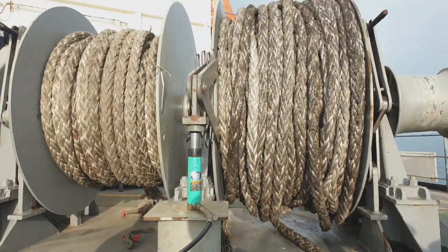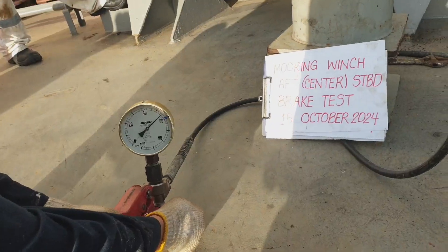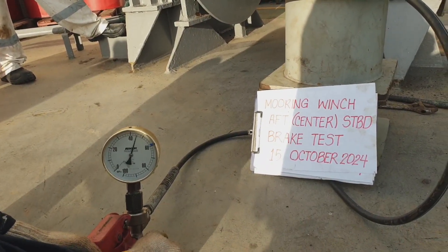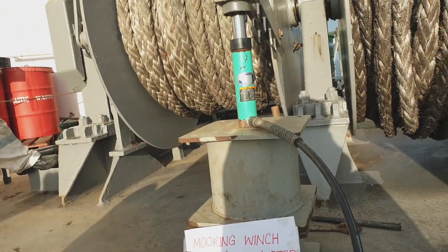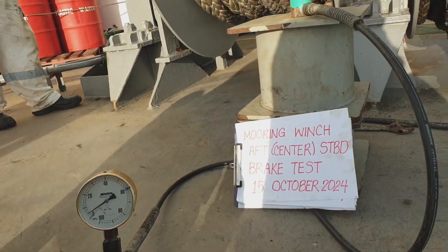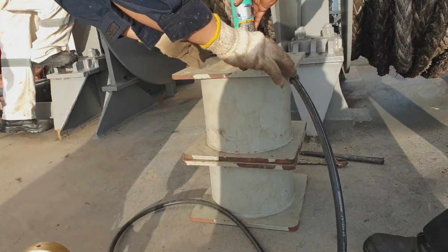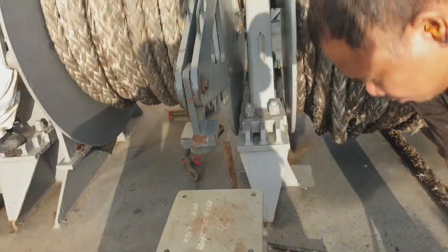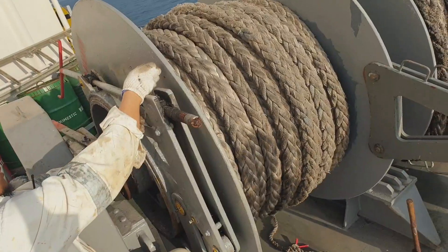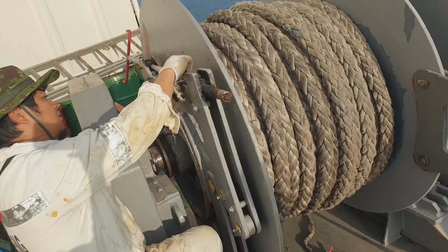At this point it is holding — holding at 60 megapascals. Put a mark at the reference point. From that reference point, we confirm the brake can withstand 600 bar or 60 megapascals. As you can see, our chief officer is putting a mark on the brake.